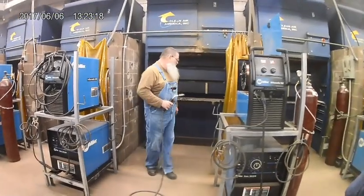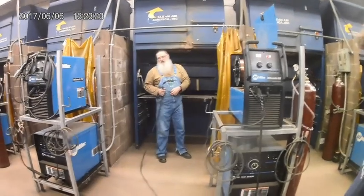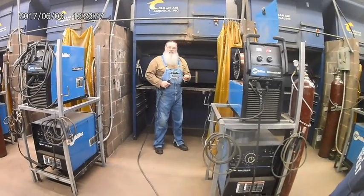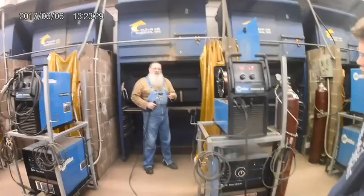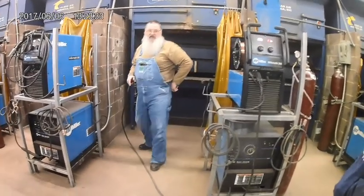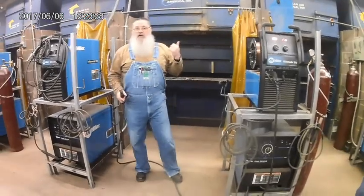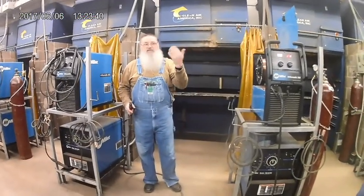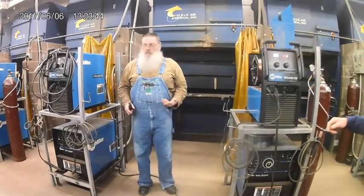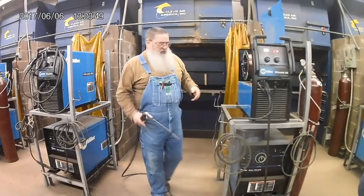If I come over and lean up against this table, and let's just say I'm sweating a little bit, and then I pull this trigger a little bit and touch that wire, I'm going to get a little Edison medicine. Okay? Right now, I don't feel anything. If there was a tear in the back of my pants where my bare skin got on there, it'd give me a little bit. If my bare skin was on there and I was wet, both on my hands and on my back right here, then it would hit me even harder. Okay? So being dry is kind of important when you're welding.